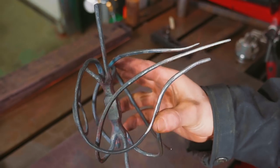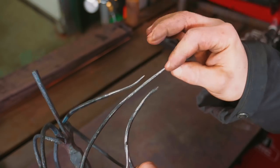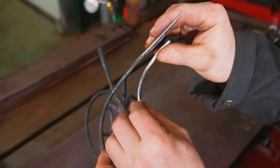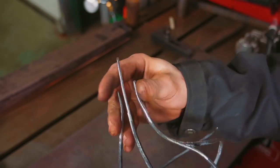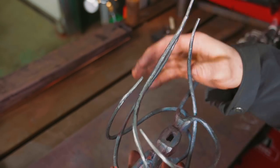We've got the bits polished up. We're going to clamp the pieces together, tack them, get rid of the clamps, finish the welds — welding here, here, and here. Then a little bit of grinding, and then some forging. They should be all ready and done.